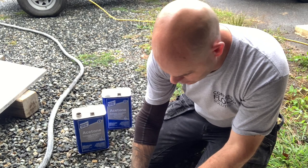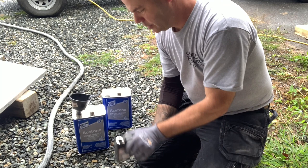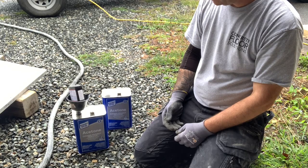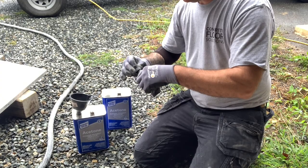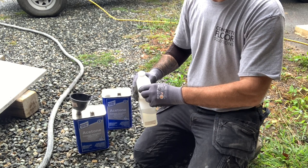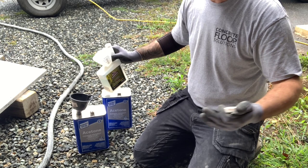And if you're gonna stain it, you surely want it to last. So just pour your container of stain in the gallon of acetone. Then we have this Ameripolish Penetrating Agent Plus. What this does, it extends the dwell time of the stain. When you spray this on the floor, it literally dries in like 5 seconds. So this extends the time so it dries in like, say 20 seconds so it can penetrate farther.